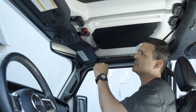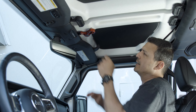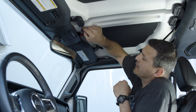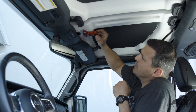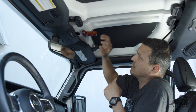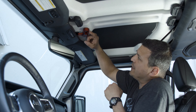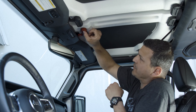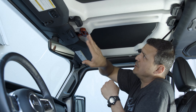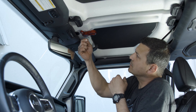This one is actually one that requires and can use one of those nylon washers. You can tell by how much pressure there is when you actually lock it — there's a little bit of movement. That's fine, they will all have a little movement. And the reason you can hear it more is because these are aluminum where the old ones were plastic. But you can feel that the engagement is not as snug as your old one. Of course, you can torque aluminum a lot more than plastic, which is why we include this little nylon washer.